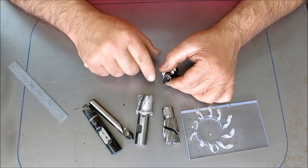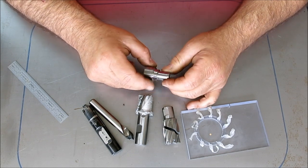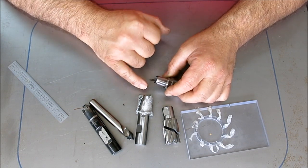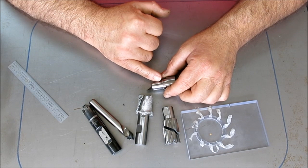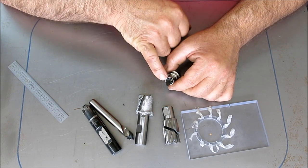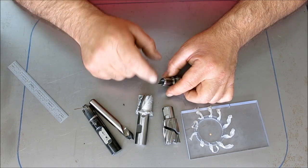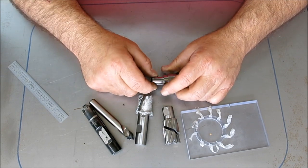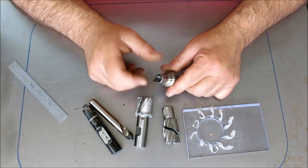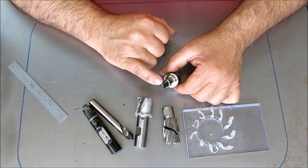Anyway, you can see there's something stuck in there, and it's pretty much welded in there, and it blew up. That was a solid carbide boring bar that's buried down in there and bumped into something or chips packed in there. You can see the boring bar is very close to the finish diameter, so my guess is there was some chip packing or something in there, and it just kind of got stuck, and then pew, welded that off. So they had to pull the piece out, saw it off, and then start up again and go. So that's about a $300 boring bar there.